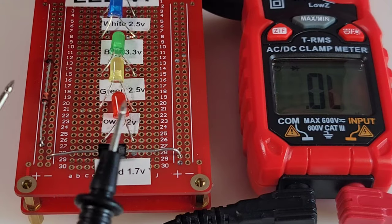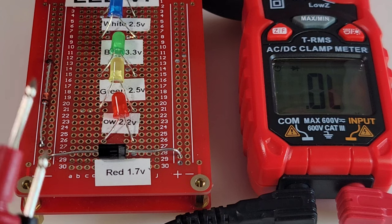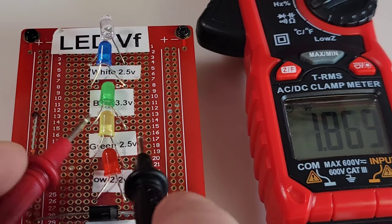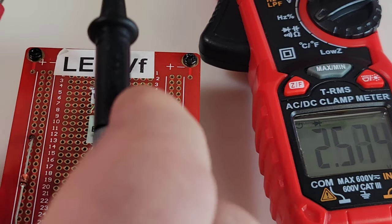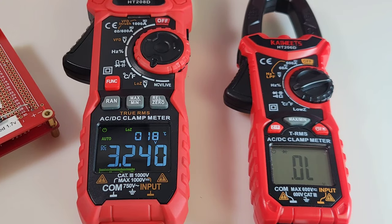Time to test some diodes. Starting off with a standard diode — 0.558 of a volt, and we have no audible beep. That's too bad. Onto an LED — it is lit. Testing the forward voltage drop on red, yellow, green, blue, and white — five out of five in terms of illumination and forward voltage drop indication. Good job, just missing that audible beep. Output voltage in diode mode is a very respectable 3.2 volts.